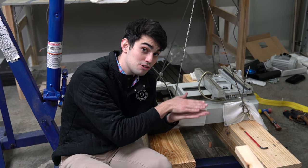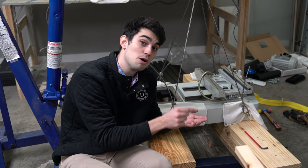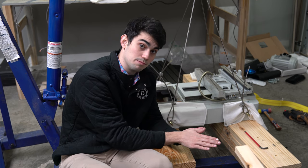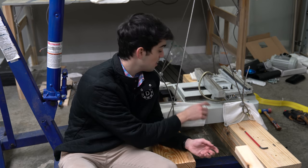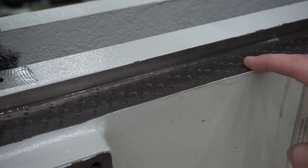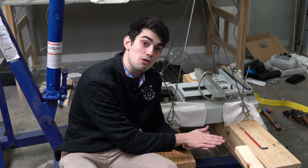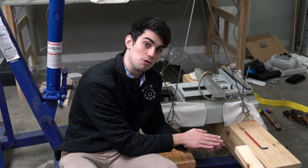An ultra flat surface means a better fit between two components, and in the case of mills, it's going to allow for smoother motion. On many hand scraped surfaces, you'll find these half moon flakes. These flakes act as divots where oil pools. Now, instead of having a metal on metal contact, you're having a metal on oil.